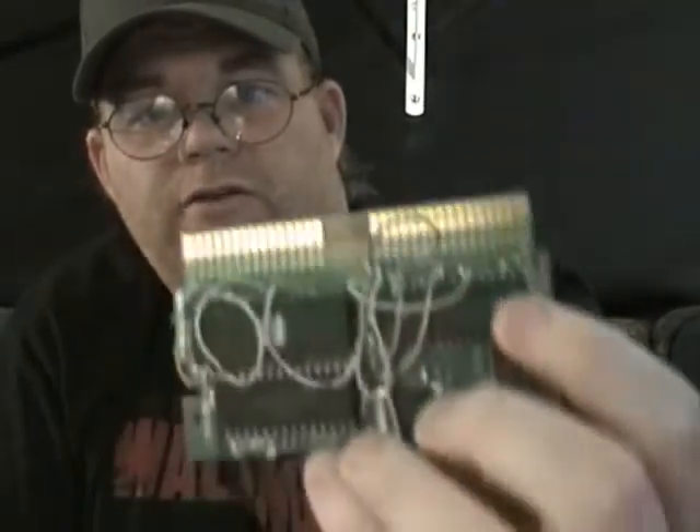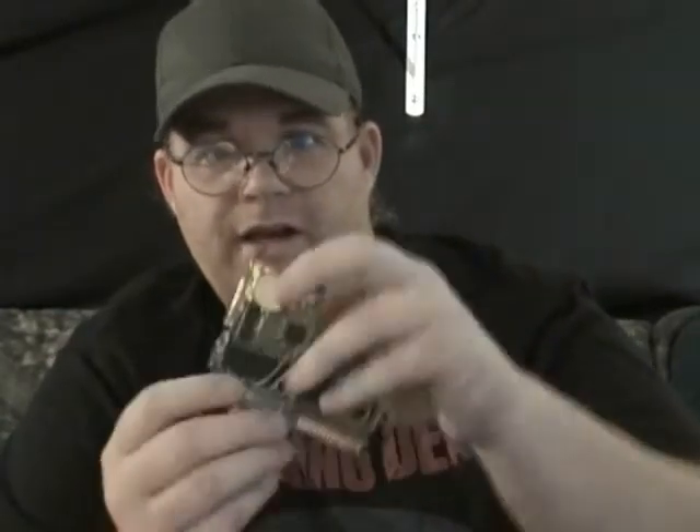The character chip over here is from another game. There are certain games — you have to look at the part number, and it has to be in the CXK 5864PS family. I've used two different types and it'll work in that family. I'm not 100% on that, and I know there are other character chips that'll work. What I had to do to get it to work is take the Nintendo top off, take this wire, and actually shove it into the pin connector, then put the board in without a shell — and it worked perfect. So I know it works. It's just this wire — you've got to get a pin to connect it to so you can just put it in a cart and use it normally.